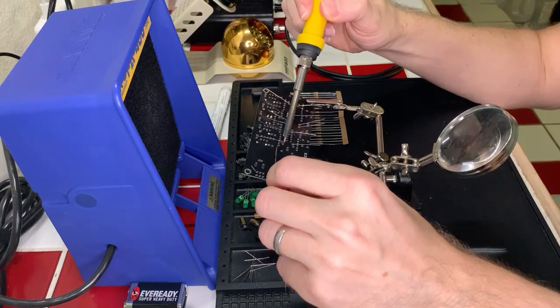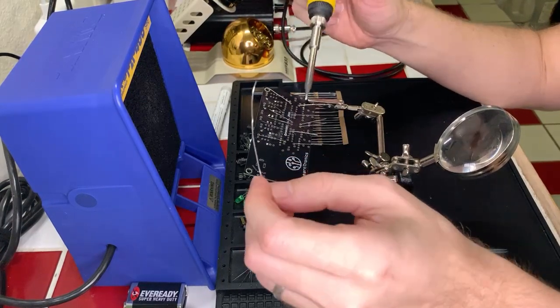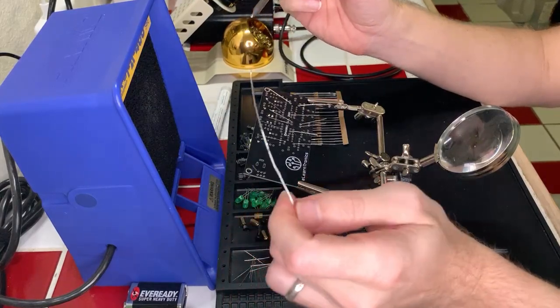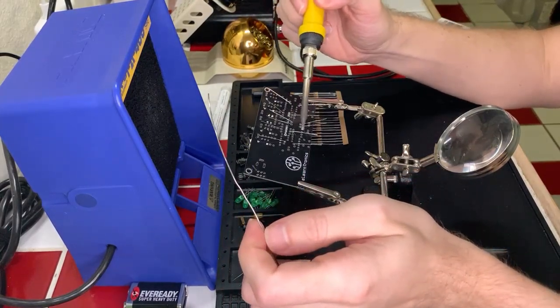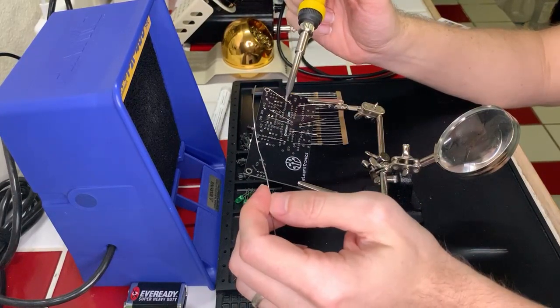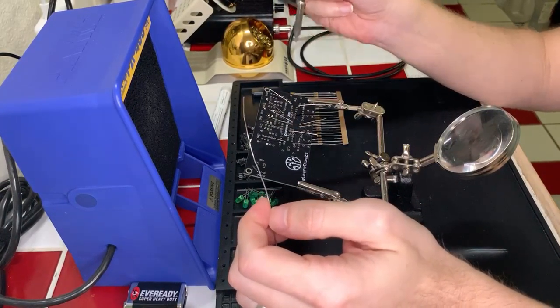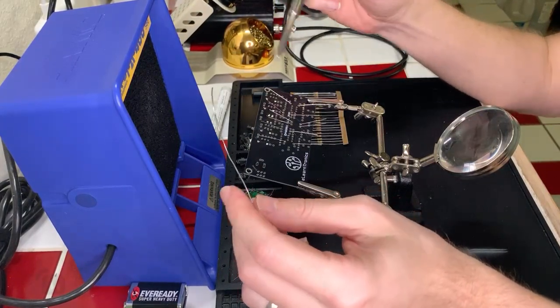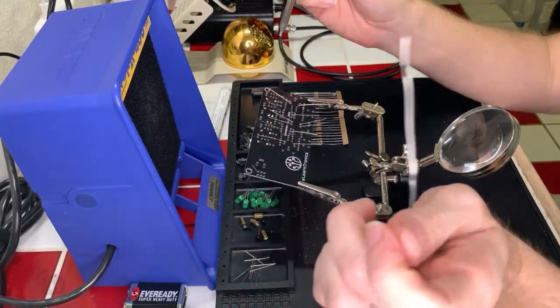So when soldering, from what I've learned, you just hold it to the pad for a couple seconds. The pad is the actual circuit here, or the board, and then the lead is the thing sticking out. You only hold it there for a few seconds, just enough so that the heat transfers from the iron to the two things, and you want to touch both. And then you feed the solder